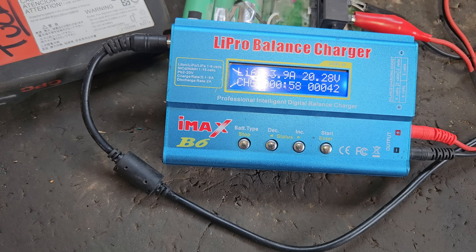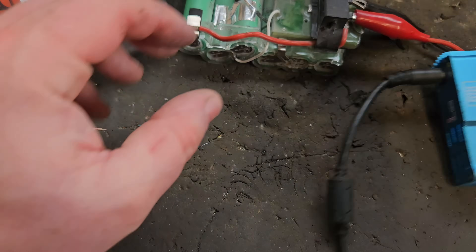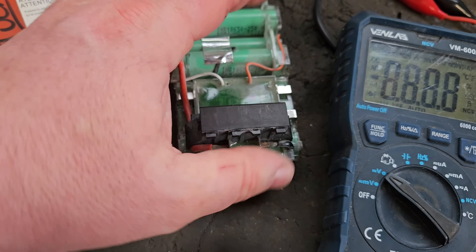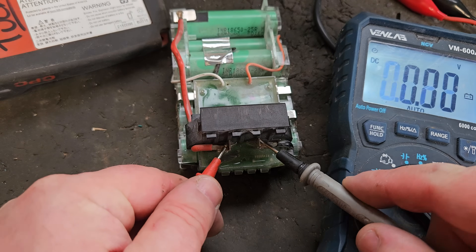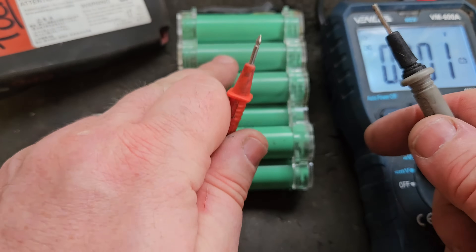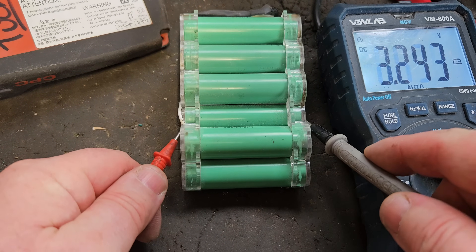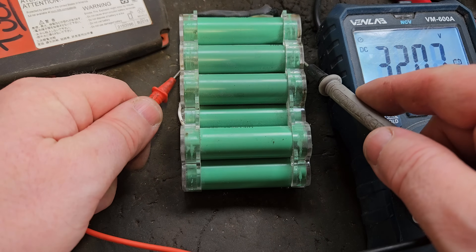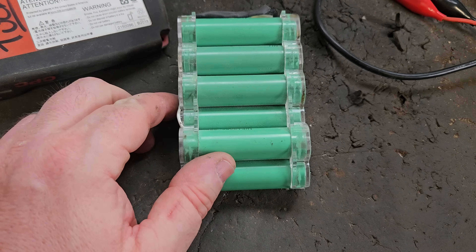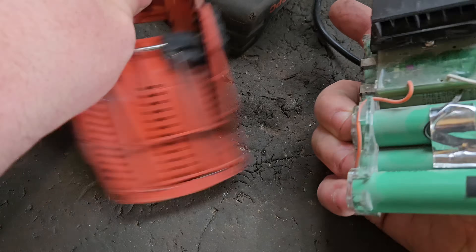Just for educational purposes, we're going to stop the charger here now — it's been charging for a minute — just to see where we're at voltage wise. I'm going to take the overall voltage of the battery and the individual cell voltage. It's reading 19.56 volts overall. Going to the individual cells — they never heated up, they're still cool. At 3.24 volts each, they're all sitting fairly steady, very close to each other in voltage, so that's quite balanced.